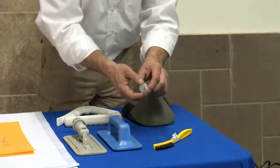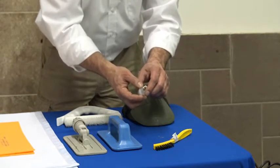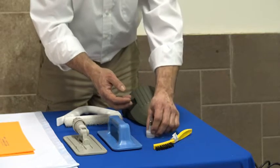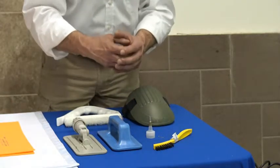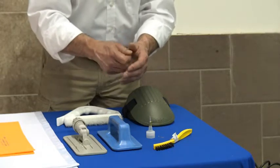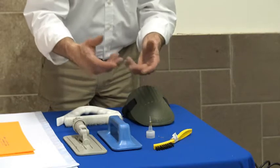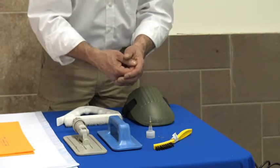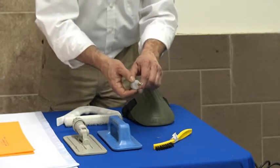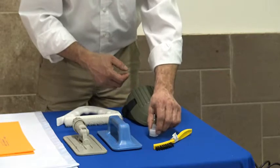And a metal tip applicator. Typically with the kit, you get a Yorker top, which is all plastic. What happens is when you're rubbing the plastic onto the grout, the tip of it ends up wearing and getting clogged, so you're required to clean it out, and it just takes a little bit longer to do the job because you're ending up having to fuss around with the tip, versus this metal tip does not wear, so it'll save you some aggravation. Either way is fine.